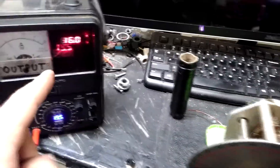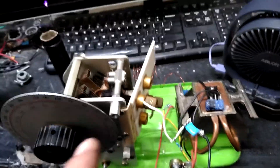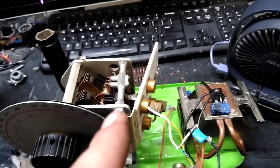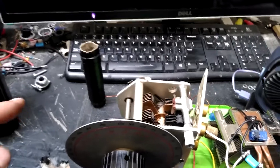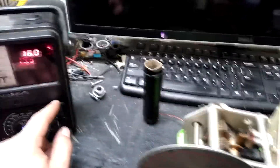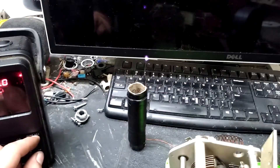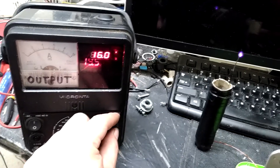MOSFETs popping - I'm back playing with this circuit. I was really interested in these high frequency circuits but still dealing with this clunky variable capacitor, but it actually seemed to have done the trick. That was my problem before - I would imagine capacitor plates too close together. But I can actually crank this up now a little. That's my little flame right there at about 32 watts right now.